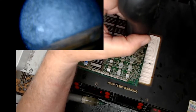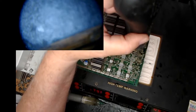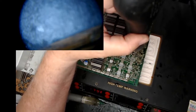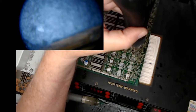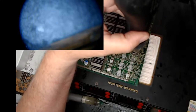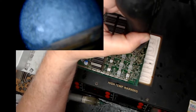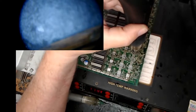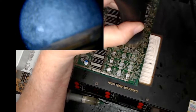So on it goes. When I feel that these guys are melted, I'll actually remove the heat and I'll apply more flux. This chip is probably pretty close to being on, I would think. Yeah, I like how the right side's looking here in the reflection on the light. I'm a little rusty on S17 Pros. I don't do that many.